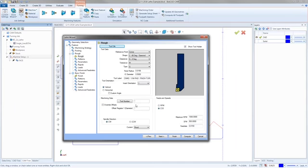Right here's the tool number and then the offset. So you have override offsets. If you want to change that, you just type in what you want to do for your offset. Spindle direction, clockwise, counterclockwise, coolant types, and then feeds and speeds. We got 2 different ones. BobCAD lathe, we don't even try and calculate the feeds and speeds for the lathe portion